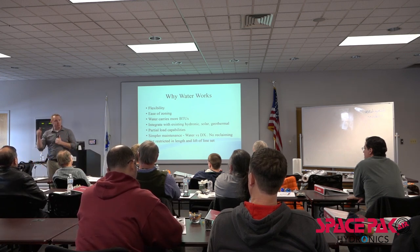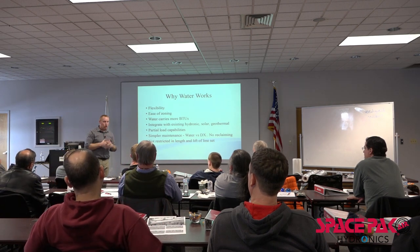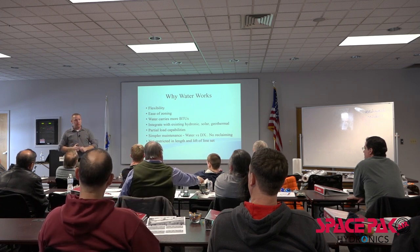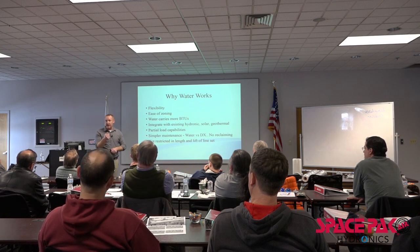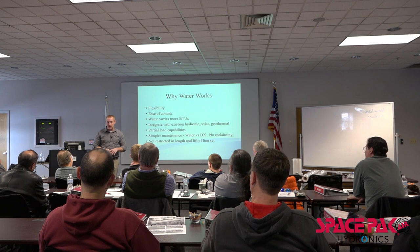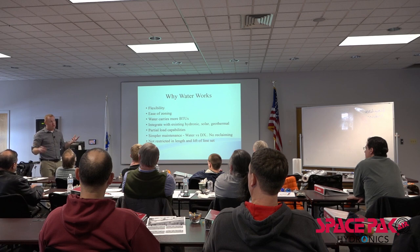So when the sun's out and his PV solar is making him money, he's heating up that water to 125 degrees, I think it was. When the night falls and the radiant calls, which was a design temperature of about 97 degrees, it sips off of that 900 gallons all night long, drops the level of those tanks down to not even 100 degrees by the time the night goes, right? The next morning, I've got it on a timer. It's going to turn those heat pumps back on and heat the tanks up during the day when the sun's back out again. So using virtually no fossil fuel type energy.